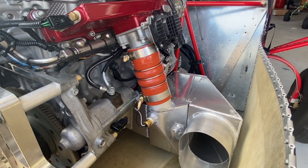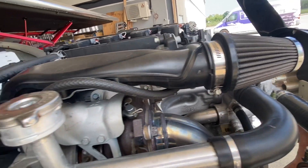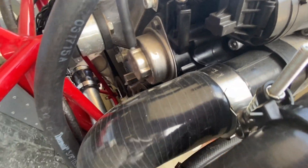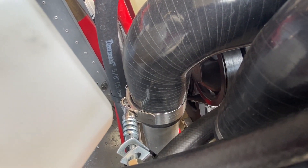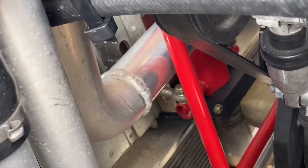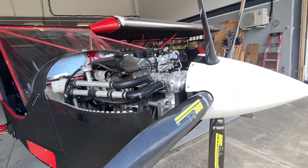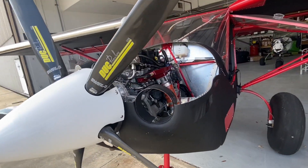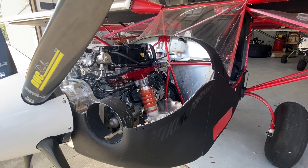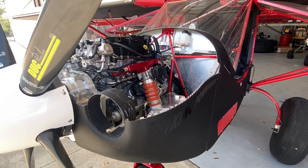On the output of the turbocharger — that's on the other side of the engine — there's an inlet filter, then it comes back through the turbocharger, exits here with good clamps, a 90-degree fitting, another constant-tension clamp, and then it drops down into the cowling and goes across to the other side. The main thing to point out is the quality of the clamps. On a yearly maintenance basis, it wouldn't hurt to remove all the ducting, wash the parts in soap and water, get all the oil out, inspect your clamps, and then put it all back together — you don't want any of these ducts to come apart.